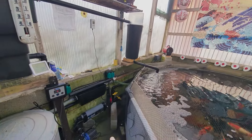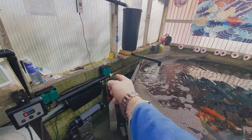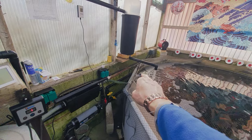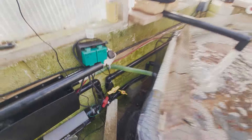Once I get that air source heat pump properly working, I've got to supply three different sources: the bypass which I'll probably leave partially open, the valve going to the air source heat pump, and then the valve to this. At the minute I'm pumping too much in there — I've got it on its maximum but at least I know it can't overflow, which is a good thing. I've got this on full and I've not reduced it.